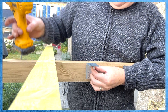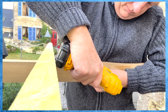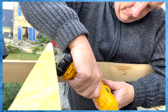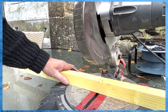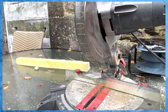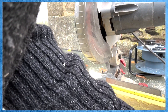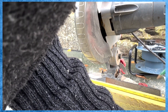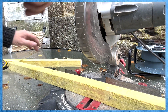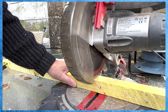I'm adding these metal brackets to hold the roof struts up. They're just slightly bent out of 90 degrees, which helps us with the incline of the roof to ensure that the rain falls forward. To keep the front of the new lean-to straight and square to the house, I've had to cut each individual roof bracket slightly differently because of the way the wall angles away from the property. Sadly we didn't realise this when I cut some of them in the first place, but we managed to solve it in the end.